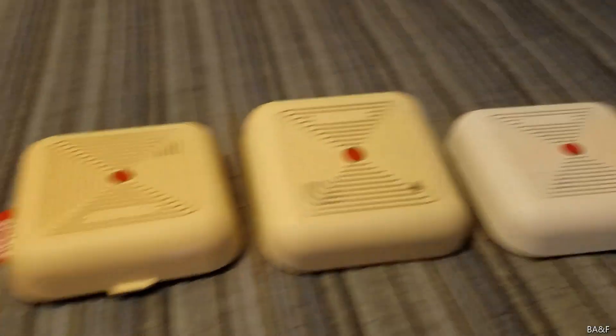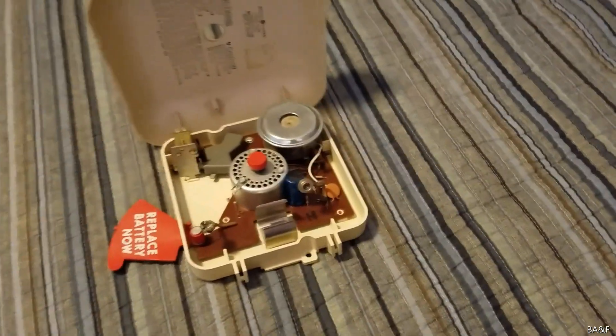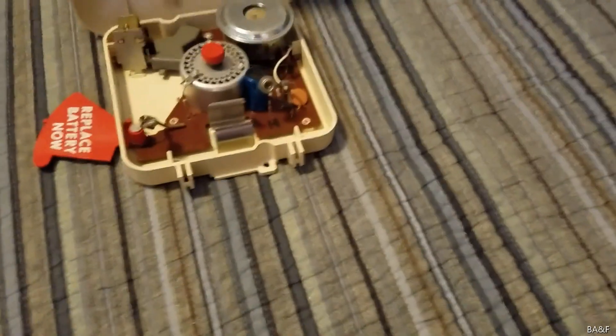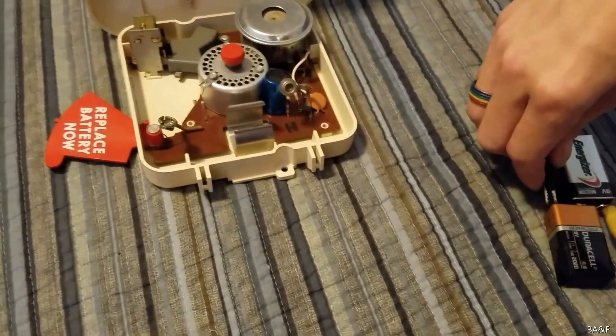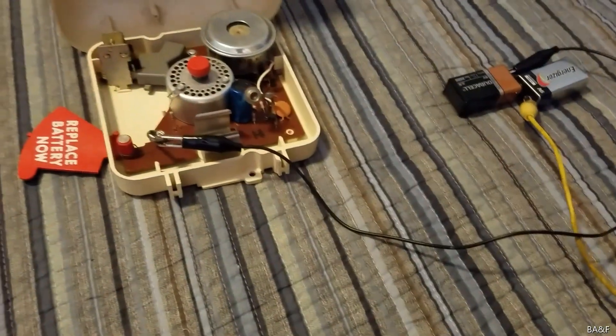Let's put all these aside and focus back on the 101. I'm going to power this unit up. The 12.6 volt mercury batteries are illegal and not made anymore, and the ones you can buy on eBay are pretty much all long dead. So I've got one good 9 volt battery and one slightly dead 9 volt battery, which gives me around 12 to 13 volts. I've already tested it with this setup so it should work. This is the plus terminal and this one is minus.